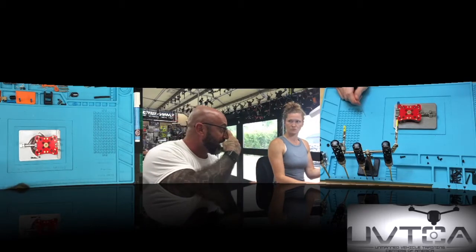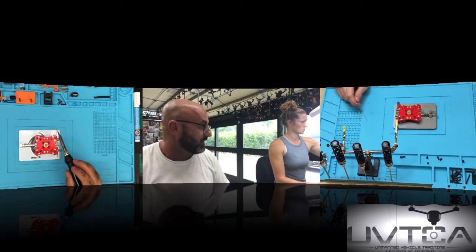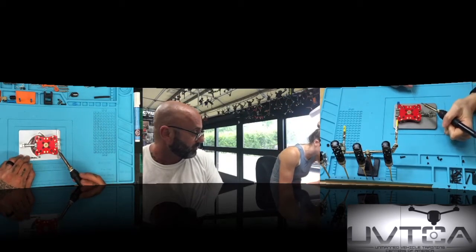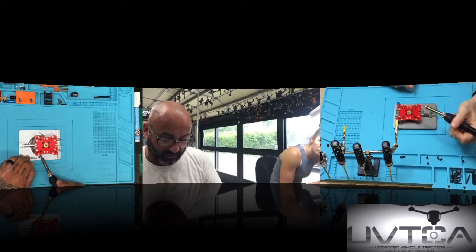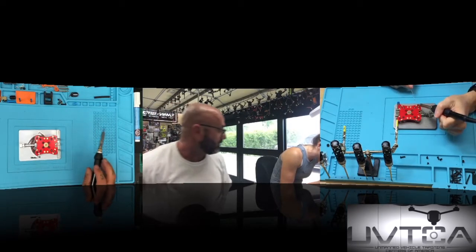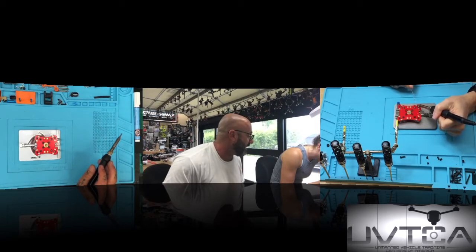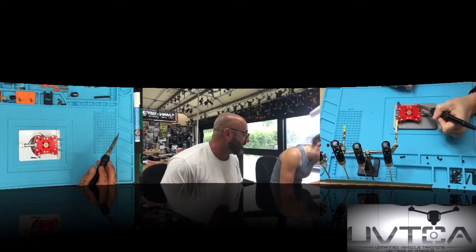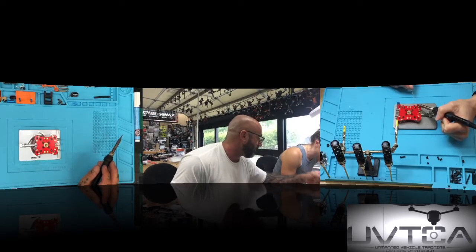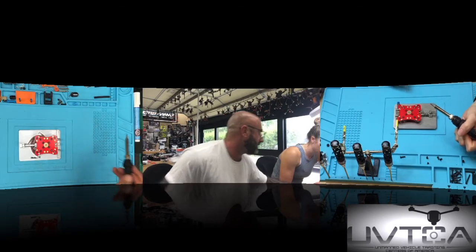So the first thing you do now is go in the copper sponge again. Okay, get it clean. All right, now put your solder on the first square that you wanna work on. Yeah, and then watch this, ready? Just paint it real quick. Okay, yeah, use the side of the soldering iron, there you go. Put the piece on there, and then just paint over it. Okay, now let go.